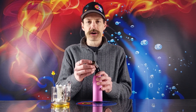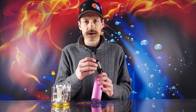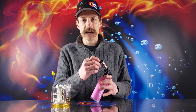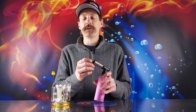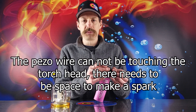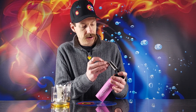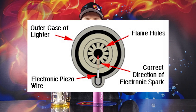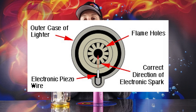Here's another pro tip if your torch is not lighting like it used to. Sometimes the piezo button no longer lights the torch because the little wire up here has somehow got moved, displaced, or messed up — numerous reasons why that could have happened. So with the butane completely turned off, you're going to take a pick, get inside there, and go ahead and move it a little bit away. Sometimes it's touching the metal there, therefore it's not going to create a spark, and that spark is what's needed to light the butane.